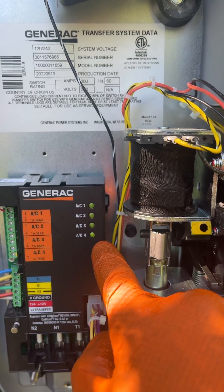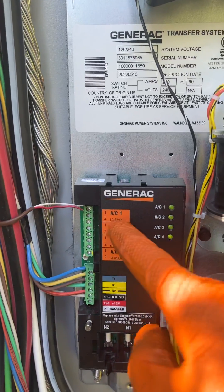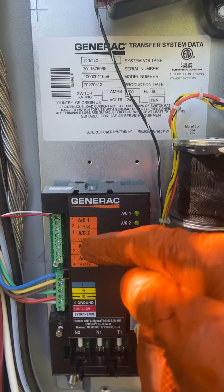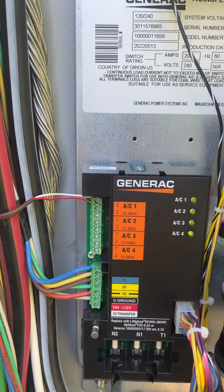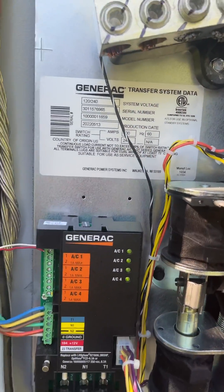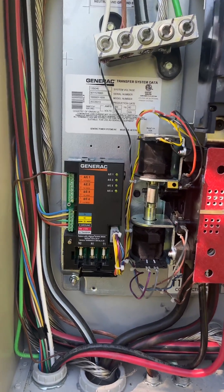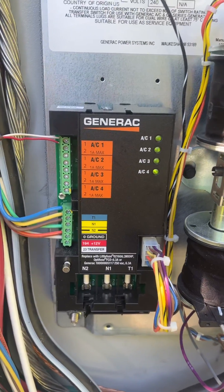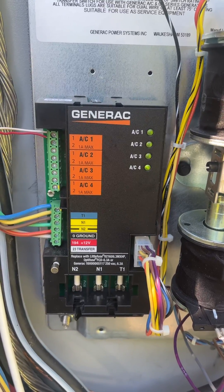One is the top priority, four is the least priority. As you can see, we have one condenser here at the house — the white wire is connected, then comes through the relay, goes back out through the red wire. It's easier if I draw a diagram, but I'm in the field right now so can't do that. Think about a light switch — this is an automatic light switch that has smarts built into it from that control board.